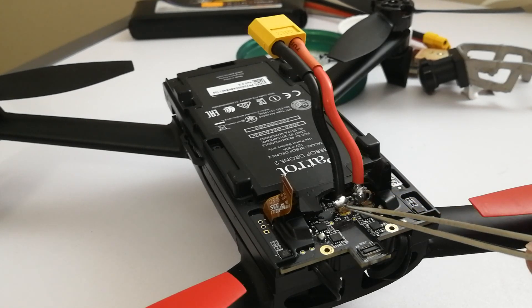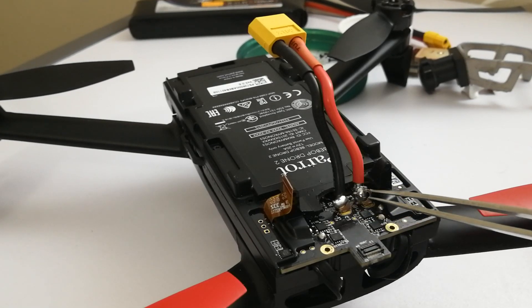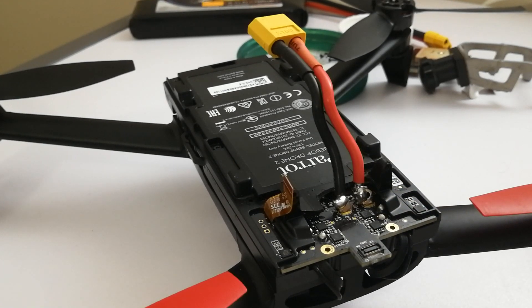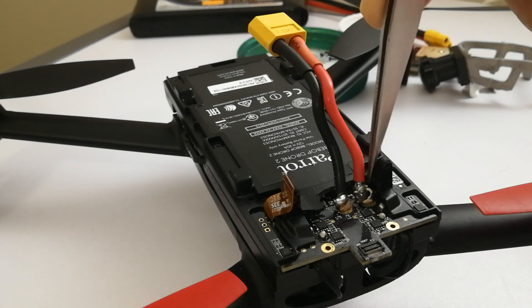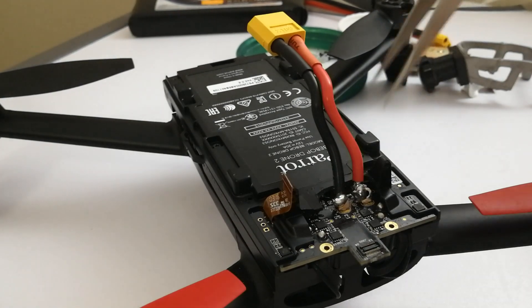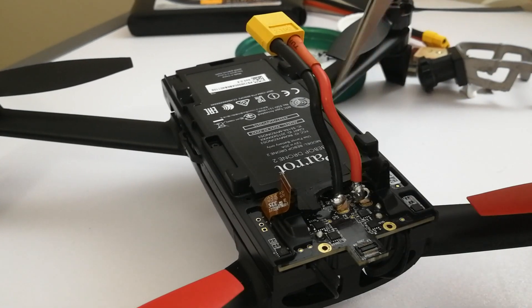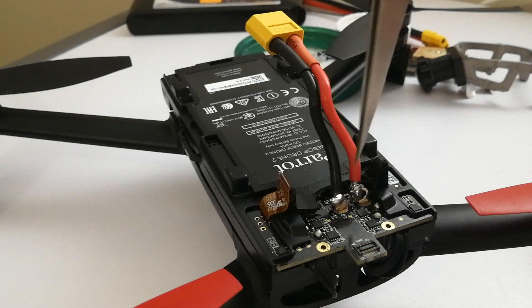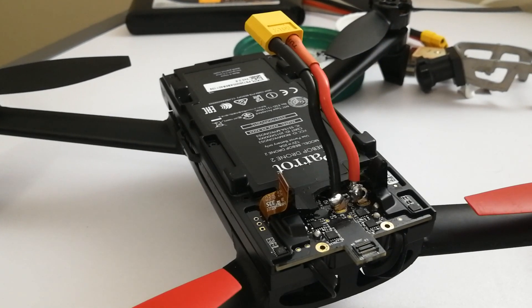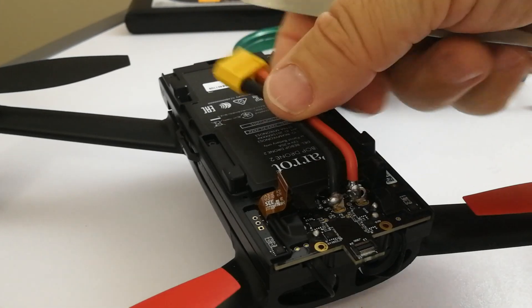That leaves these two little tabs sticking up, and you can sort of half see them there under the solder. And they're nice and easy to solder to, so it's really a great setup. The only additional thing that I did — and I do recommend this — is you just get a Dremel and clear a little bit of extra space around here. And to do that, I did remove this cover plate that sits over the top of the board. Had to undo all the little screws, pop it off, Dremel out that little bit of extra space, and that just gives you a little extra bit of room to move. And once that was done, put that back on. So easy just to solder two wires on there, and there you go. It's done.